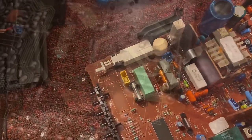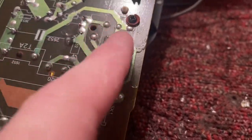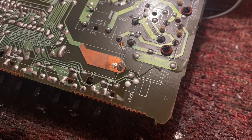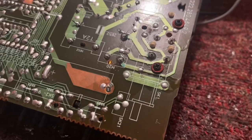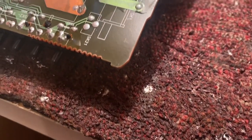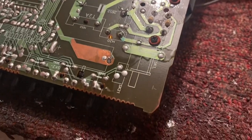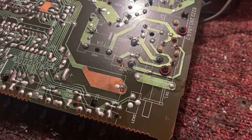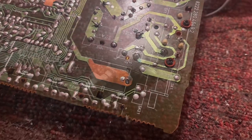I'll take that out and we'll see where we are. Looking at the back of the PCB, the keen-eyed among you will realize there are far too many contacts on here. That's because this type of switch is double pole, but there are two sets of the double pole, which means it probably switches some low voltage thing. I can chop that part of the switch off - I'll show you what I mean once I take it out. I'll take the switch out and then we'll inspect it.